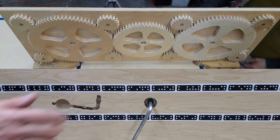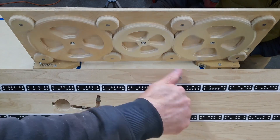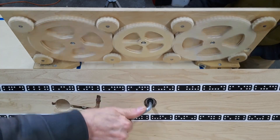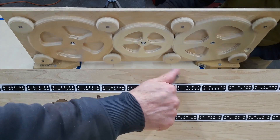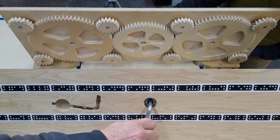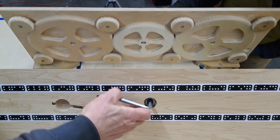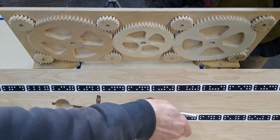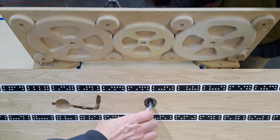The concept for this mechanism is pretty simple. Turning the cap bolt in the top center of the board rotates the center gear, which then rotates the two largest gears and they rotate the eight small gears around the perimeter. The small gears have fixed bolts which are installed into threaded inserts in the board, so they act as adjustable feet that raise and lower the tape board.